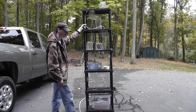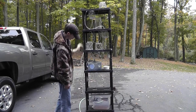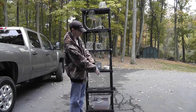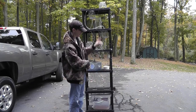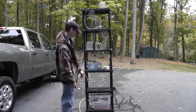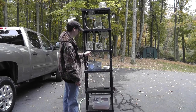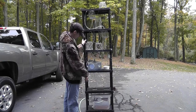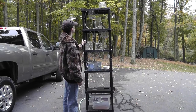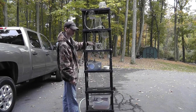This is basically like Thomas Gaskell Allen back in the 1920s had intended it. It's pretty much the same thing, with the exception of instead of having a lever on a fulcrum with a tray on one end that catches water and a counterweight tied to a bike-eccentric gear to a valve — instead of that, we have this assembly right here. A little bit different, but the same in principle. The other main difference is the drain tank. Other than that, it's pretty much the very same thing as what he had back in the 1920s, with an additional input tank because it's harder to fill this thing up through the top.